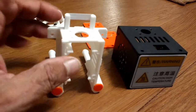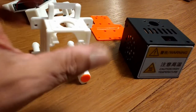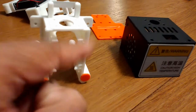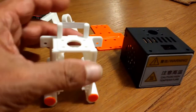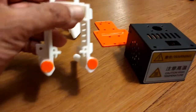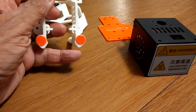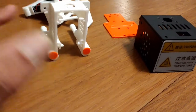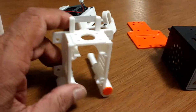The hot end simply attaches here with the existing aluminum clamp — that little collar they provide. So I didn't design a collar for this because you can reuse the same one from the machine, and it's better because it's metal. That clamps right underneath here, and when this is fully assembled with the hot end, these bottom sections of the 3D print raise up from the nozzle end about two to three millimeters in height, so that it clears the part.